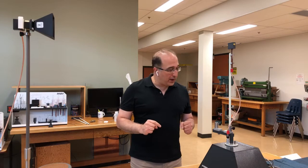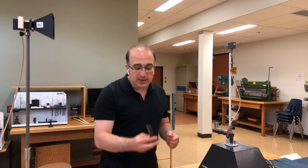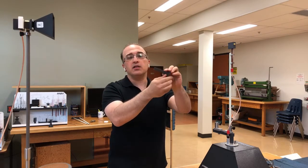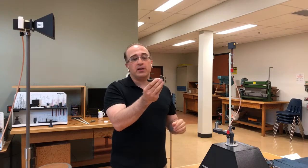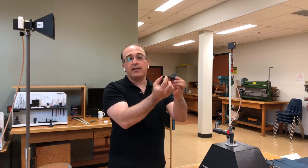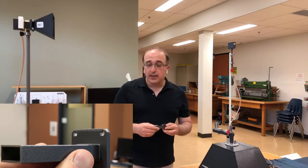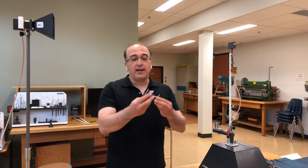Now we need to set up our receiving antenna, which is the antenna under test. For this experiment, the antenna under test is an open-ended waveguide antenna. This is essentially a waveguide with the end left open — the guided wave travels through the waveguide and at the open aperture it radiates outward, as we've seen in class.